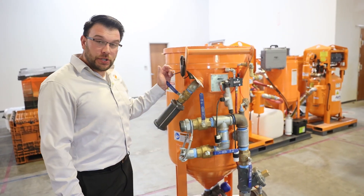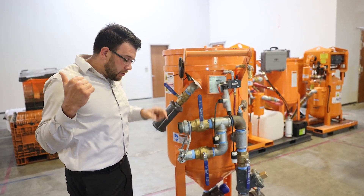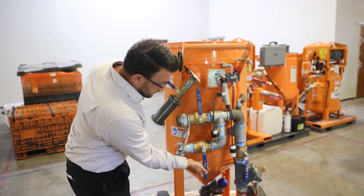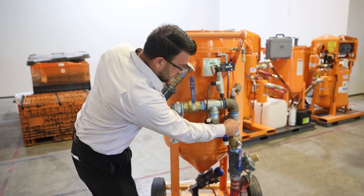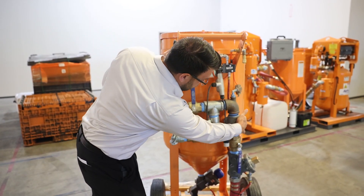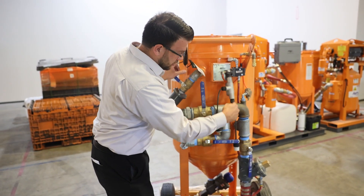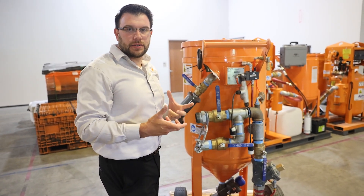What you actually need to do is shut off the inlet supply air, possibly at the dryer so you don't have a loaded hose, and then from there, open up the blowdown muffler. If you don't do this, what actually happens by letting the air drain backwards from inside the vessel through the compressor is you create a vacuum from the riser pipe through here, and you load everything full of abrasive. And when you repressurize, you then inject that abrasive through all your signal lines — and that's how you end up with abrasive in your clean signal air lines.